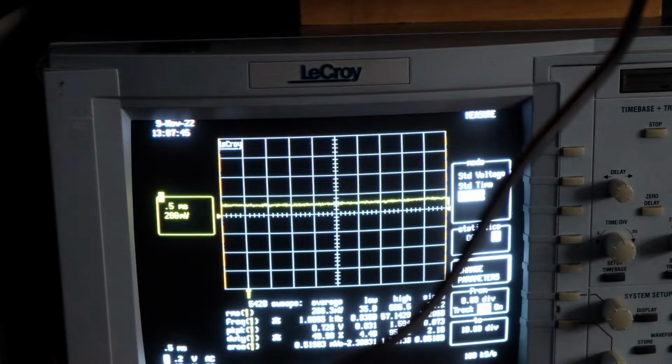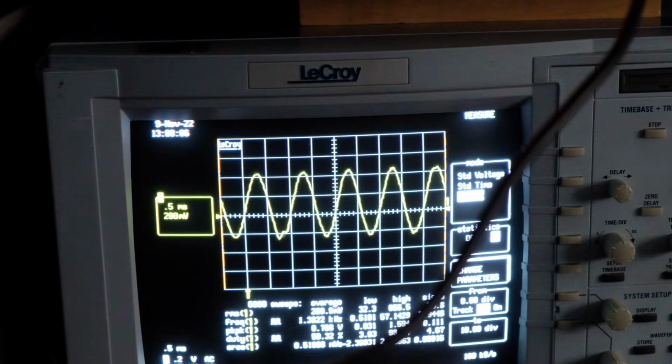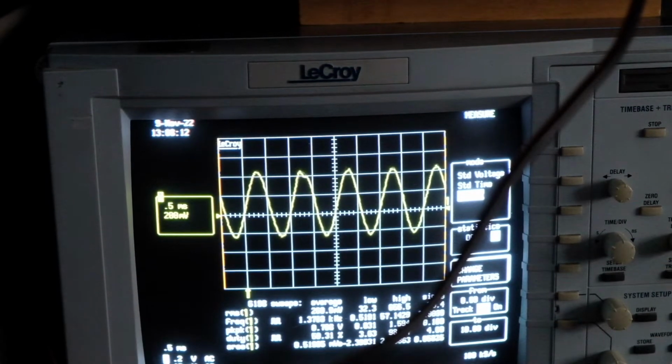As you can see, as I increase the time constant to 500 microseconds, it's gone. And if I now bring it to 200 microseconds, which is about 5 kilohertz, you can see some signal, but it's getting attenuated. If I decrease the time constant to 100 microseconds, it's almost fully passing through. This is now 50 microseconds, which is what we had earlier. So the lock-in amplifier output filter basically filters out the recovered X, or X and Y, or R signal, the phase signal, whatever that you're looking at.